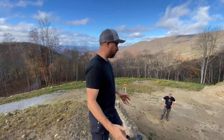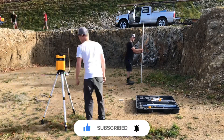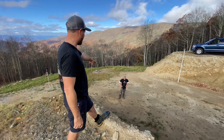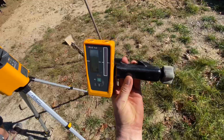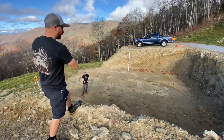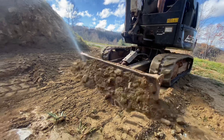First few moments of the job. What we have to do is shoot grade in the bottom using our laser level to see if the bottom part is flat, which it's not. It's about five inches higher where Ellis is than it is in this corner. So before we even pull string lines, we're going to have to get this machine delivered and hopefully use the blade to level it out. That makes things a lot easier for pouring the slab through the footings.